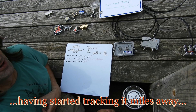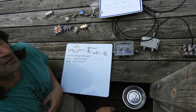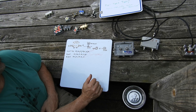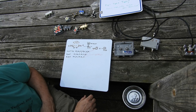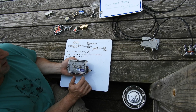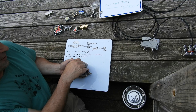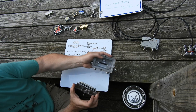The advantage of being at the end of the line is you can have a lot of splits in your house and it'll still work. But if anything gets loose, a cable technician will show up tired — he may have spent the last six hours finding your noisy wiring. You should let him in because he'll fix it for free or get something ordered. The guy on a four tap only needs a little interference to black out the whole system. In more modern systems, they've started putting in equalizers to mitigate that.